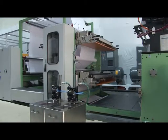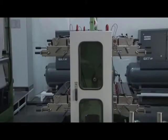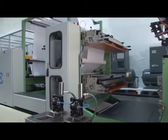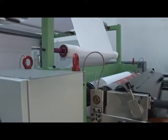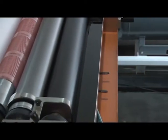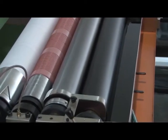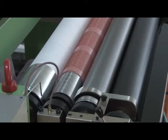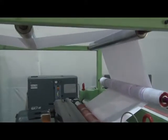The ruling and flexo printing tower is a very important portion of the machine. The printing tower has a two-color ruling and flexo printing system on each side. The flexo printing unit uses polymer stereo plates fixed on the graphic cylinder according to the design of ruling or printing required. It has one rubber roller to take the ink and transfer it to the anilox roller. The high micron superfine engraved anilox roller receives ink from the rubber roller and provides ink to the stereo plates in a uniform manner. The impression roller in this unit is a hard chrome metal cylinder.